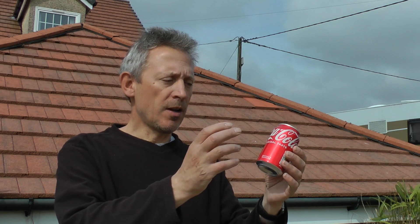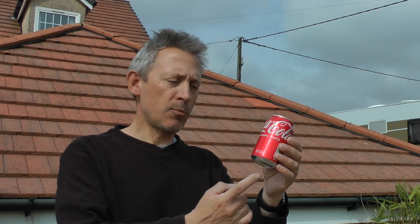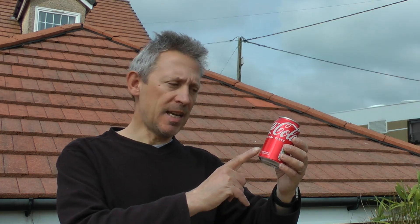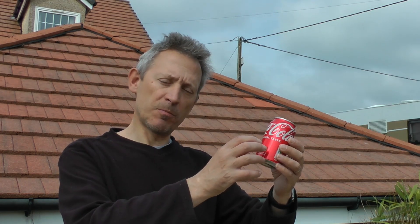You may be asking why we're using coke cans for this solar air heater. First off, they're cheap and freely available — didn't cost me anything to collect these from friends. The aluminium is about 0.25 millimeters thick, which is an ideal thickness to collect solar radiation and transfer that heat into the air passing through. You just stack them all up to create a column, a chimney, and through pure convection cold air goes in at the bottom, gets heated as the solar radiation hits the cans through the plastic of the key keg, and hot air comes out on top.